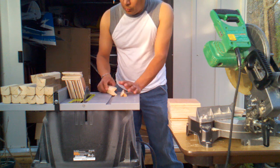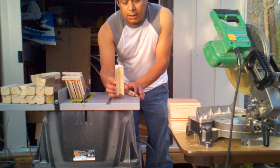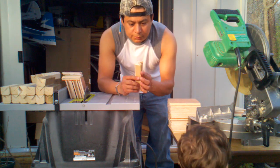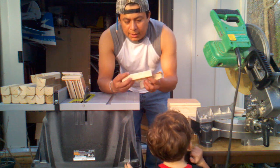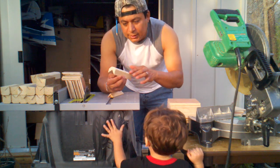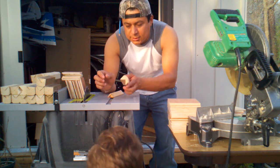So this is how we do it. We put the blade at 45 degrees and we cut this notch — you got to be careful, make sure everything goes straight and just enough to do it. We cut it like that, and then on the other side, as you can see, I messed up on this side. But we try to cut on the same angle, 45, just a little notch, so it won't be so square on top so they can sit on.